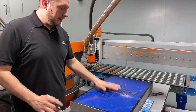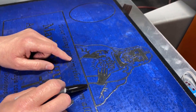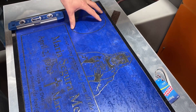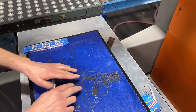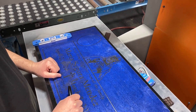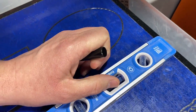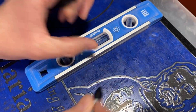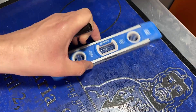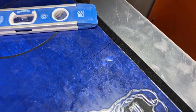So once that's done, now we have a stone that we want to program. What I want to show you is how to program a simple box. However, what I'm going to show you here is a box that is actually not just a square. We don't want to blast these areas right here — there's no need for that. We really just want to blast this area and this area. So we're going to have an overlapping box that creates one big irregular-shaped box. The first thing I like to do to save a little bit of time is find out where my box needs to be. I can always guess with the laser light, but then I might end up cutting off a section. So I'm going to start right here — I know I need to go from here, and I have the top of Jesus's head. That's going to be here, so this X right here is going to be my first spot that I'm going to start from.